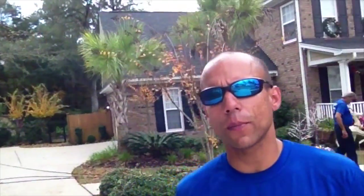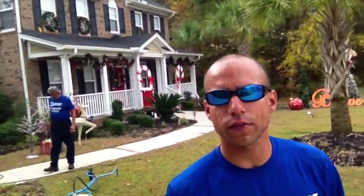Here I am at my second job for today. On this job I'll be cleaning the entire driveway, doing some window cleaning in the rear, and doing some spot cleaning on the deck. I have to be very careful at this property — as you can see it has a lot of holiday decorations especially in the back where I'll be working, so I'll have to work around that. The customer made a very specific point of that. And as you can see on the driveway there are all these tannin stains. After these don't come all the way clean with the regular cleaning, I will of course use the pump-up sprayer with a 50-50 solution of sodium hypochlorite in order to get those stains.